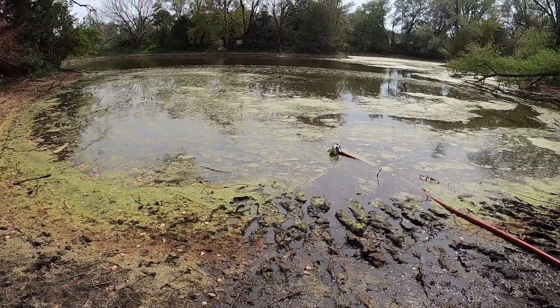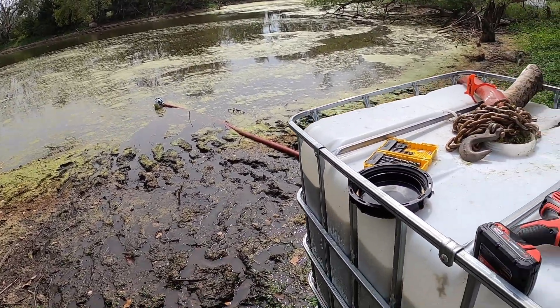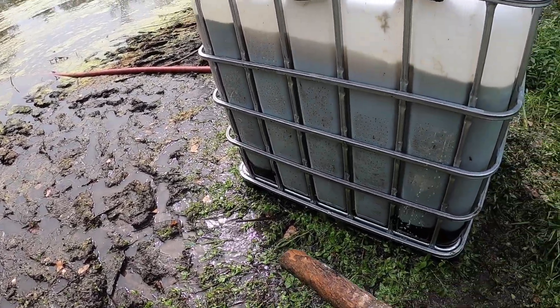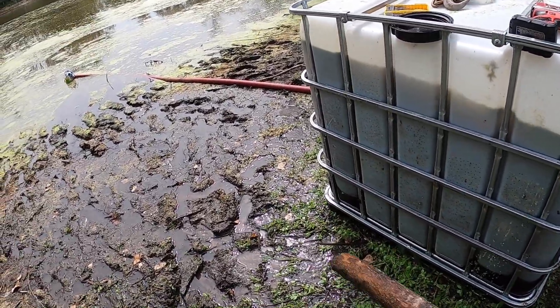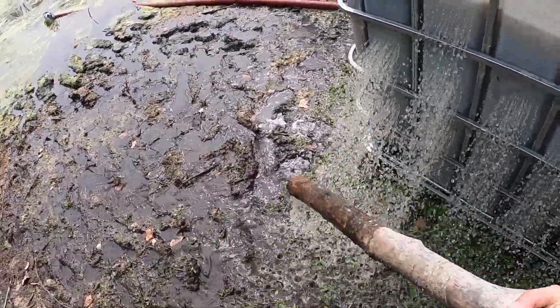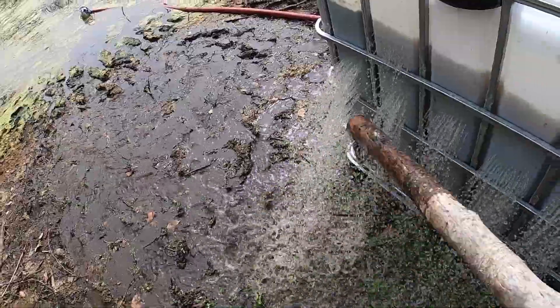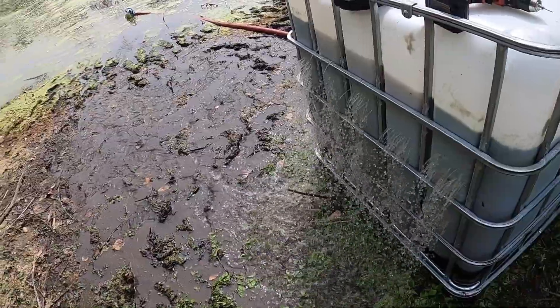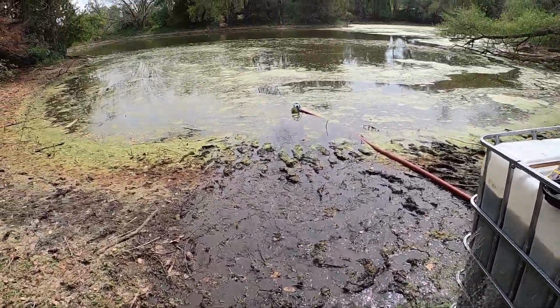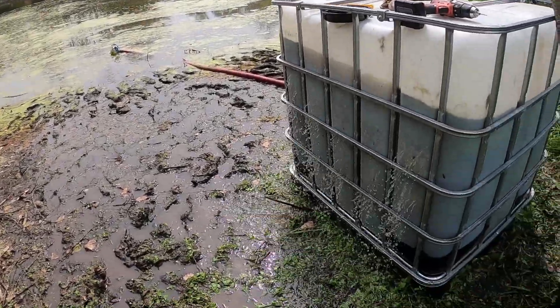Been at it for an hour or two now. We had a giant mat of duckweed out here and now it's all pretty much thinned out - it's not gone. I'm finding it best to let the pump pulse and not try to pull in too much duckweed at once because then it just clogs up the filter screen. The other problem is the filter on the tank is not keeping up with the pump even when I poke a bunch of holes in it - just keeps clogging up with duckweed. That's how much water the pump is putting in. I keep banging on the side and it works - small bites with the pump. I've got this half of the pond pretty much thinned out, so I'll keep going and see how far I want to go tonight. Works well.